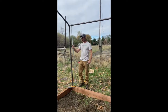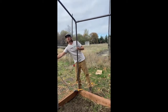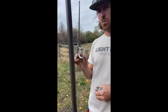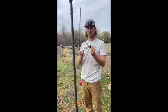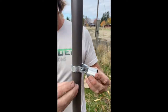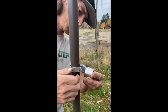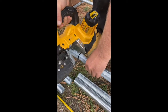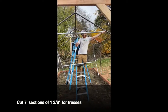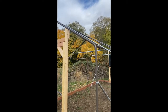Before putting channel on your outside edges, put your corner brace clamps onto your piping and mark all four corners to four feet. Use these brace clamps and rail ends, snap them into place, and use a pair of pliers to bend them back — have your corners set up before putting the channel into place. Now that all your trusses and corner braces are in, you're ready to continue with your channel work.